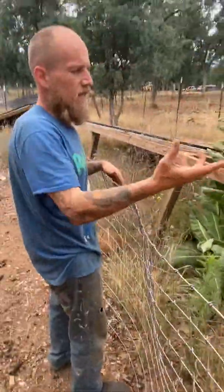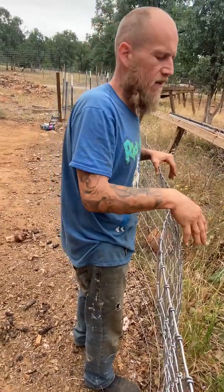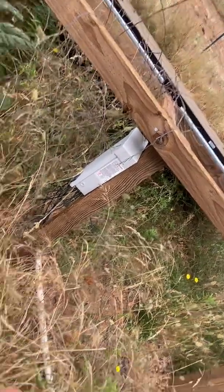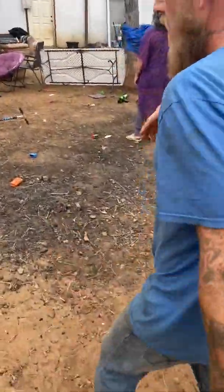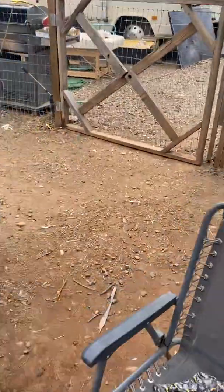After you get enough panels together to get your voltage, you do the same thing again where you're stacking them together to try and bring up your amperage. I've got about 40 solar panels here, all stacked together. They go into this breaker box — it stacks them together, and if there are any shorts in the panels it breaks right there. That sends it over to the solar controllers in a couple of wires. Then the solar controller goes to the inverter, and from the inverter it puts it into the batteries or uses it in the house right then and there.